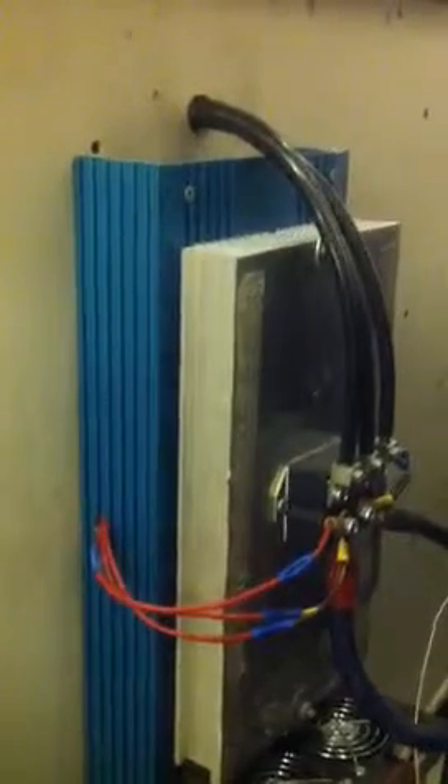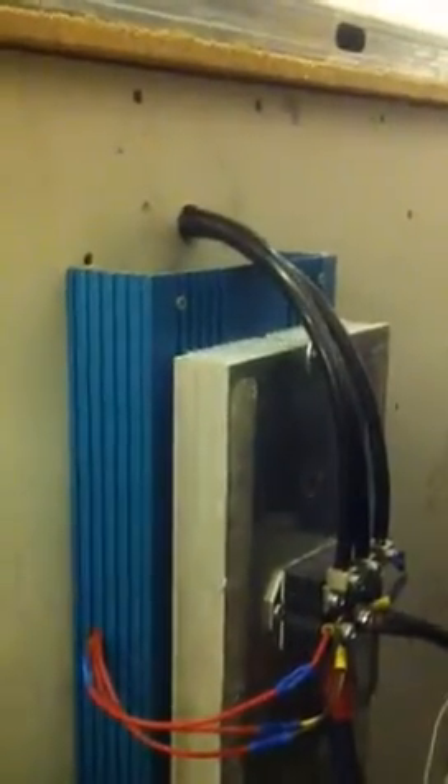My battery is about 750 amp-hours, so I like to run no more than 90 amps charging into it. When I'm running the heat pump, washing clothes, running the well pump and things like that, I have a rheostat between the charge controller and the alternator so I can adjust to keep 90 amps going into the battery and still run the heat pump and whatever else I need during the day — mornings with kids taking showers, the coffee pot, toaster, hair dryers, all that. With the headroom of that big alternator, I can put 90 amps into the battery and run everything else.